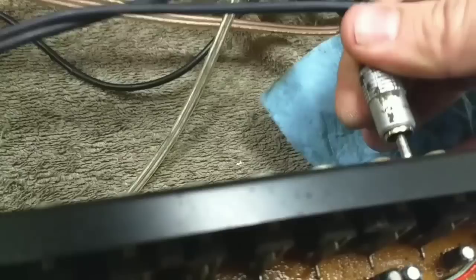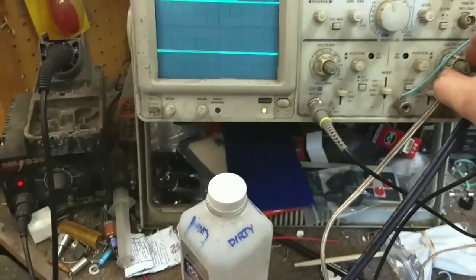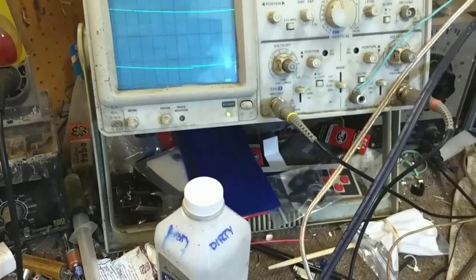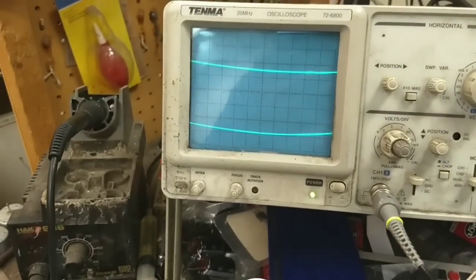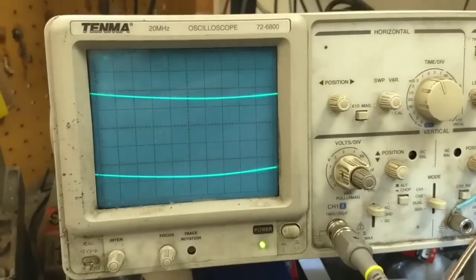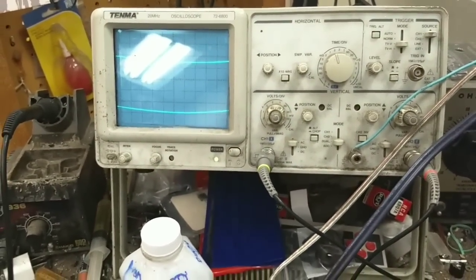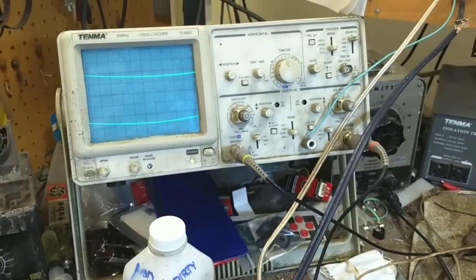Let's check and see if our phono works. We'll turn down the signal a lot here, and we'll go into our phono 1. These RCA jacks need to be burnished for sure. Interesting. Phono no worky. Yeah, I don't think so. I don't think our phono works. We're just getting a giant AC hum there. Maybe I got it plugged into 2. Yeah, phono doesn't work.